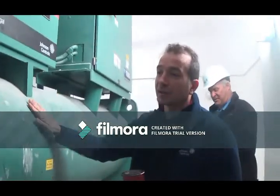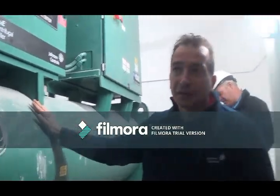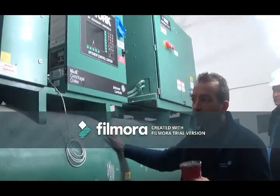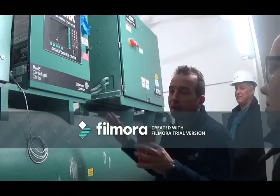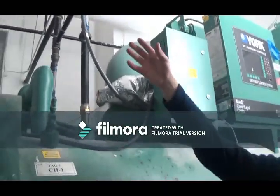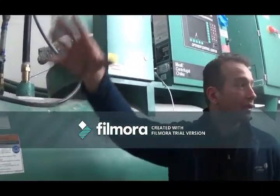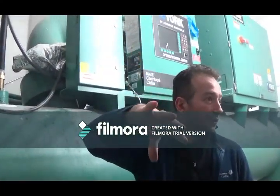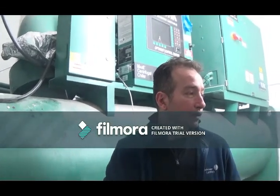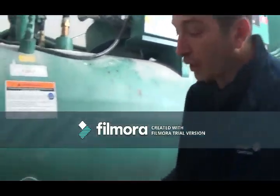Your main chiller here, your main cooling system for the building, okay? This thing here is going to take care of all your cooling needs for all the suites, all in one big gulp. So we have the chilled water that's going to be circulating through the building with your pumps. It's going to go to each suite, and each suite has their own little unit. So if we're providing cold water to those suites, there's going to be a fan that's going to blow over that cold water, and it's going to cool down their suites. So we're going to circulate that water. The chiller.